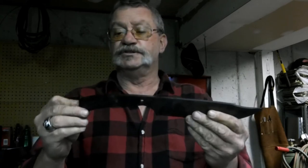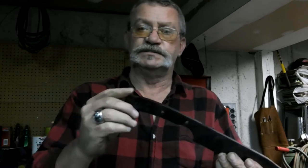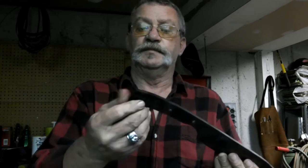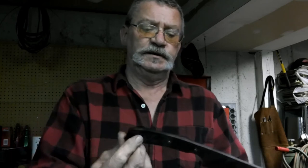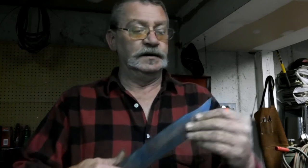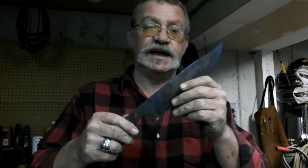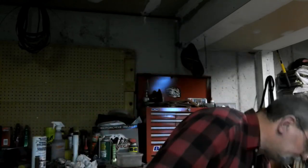We're on the home stretch now. A little bit of finish grinding. We want to kind of round this up here a little bit, and kind of smooth these edges up and these lines a little. We'll take our stock for our scales and sand those down nice and flat so we get a nice, tight, even fit.